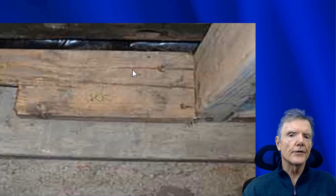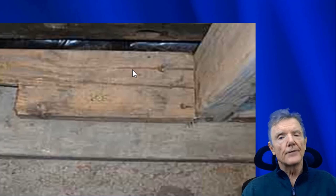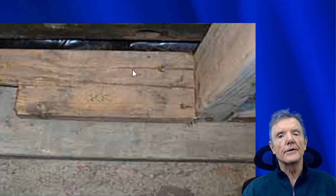The reason I bring all that up is that these blocks, for some reason, are not very predictable. You try to stay away from the end, and if you get close to the end, sometimes it'll split and sometimes it won't. And sometimes you get in the middle, you don't expect it to split at all, and it will split. So these blocks are very unpredictable, and that's probably a reason they should be avoided when possible.